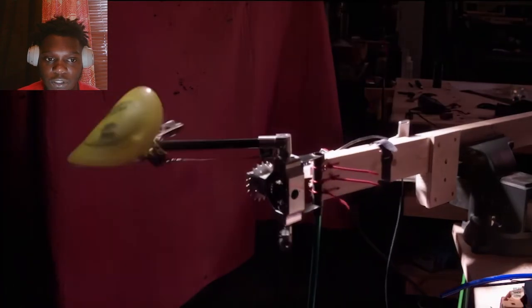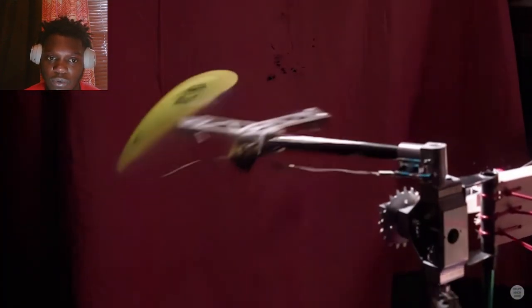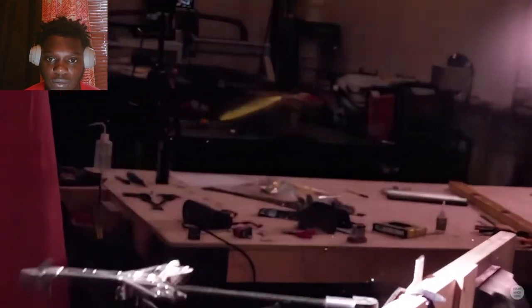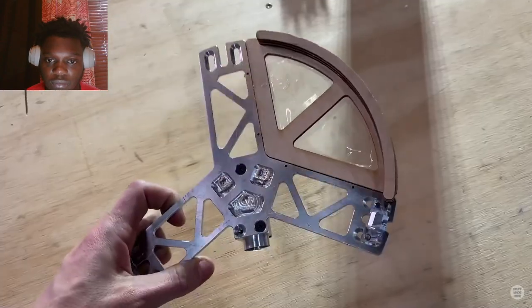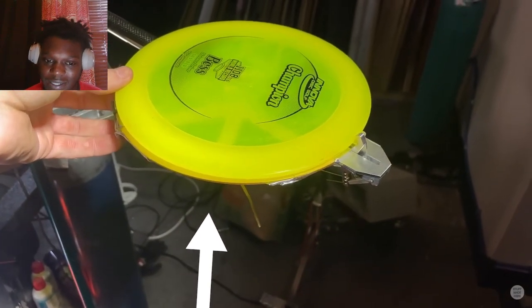25%. Shoosh. So it kind of looks like the disc is catching air under it and getting forced out. I love how we now have the opposite problem of jamming. I'm making a quick and dirty air shield to see if I can improve the situation. This should block air from flowing under the front of the disc.